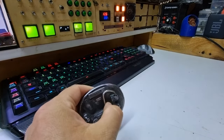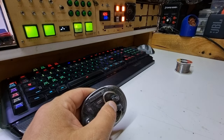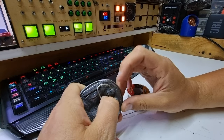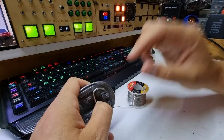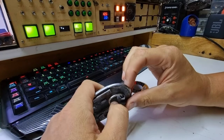Today I thought about soldering this. I have a couple of different solders at my disposal, including silver solder. But the problem with silver solder is the melting temperature is higher than this, so I'm going to end up really messing things up. This solder is fairly close to pewter's melting point as well, but I reckon with localised heat and leaving this piece in here, I'll probably get away with it.